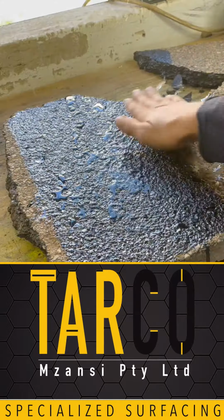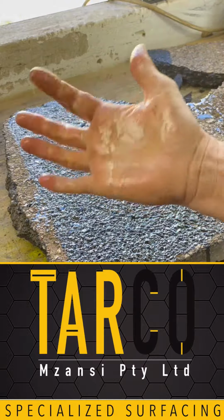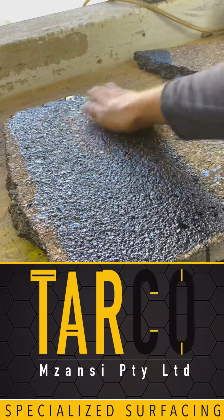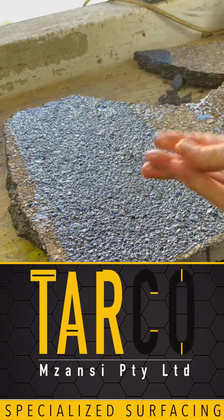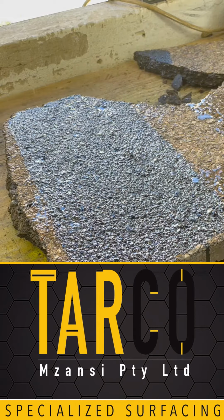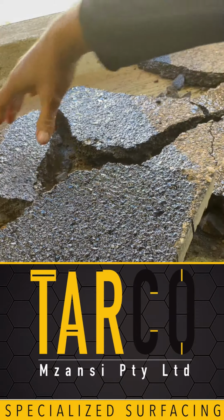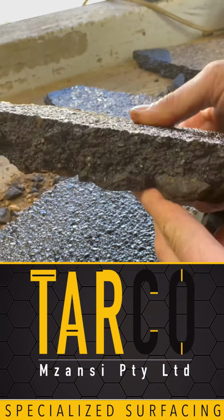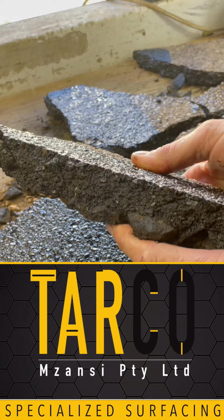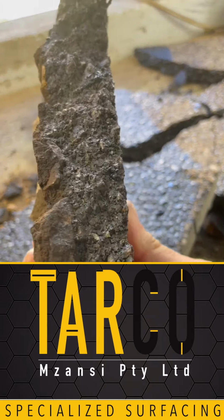All right, let's give this surface a good whack. See, once again, there's no bitumen coming off. Even if I wipe over this, that little puddle will now stay there. The water will not go down in the road. All right, let's give this a good whack and see what happened. It's completely black from the top all the way through to the bottom. The rejuvenator has gone completely into the surface.